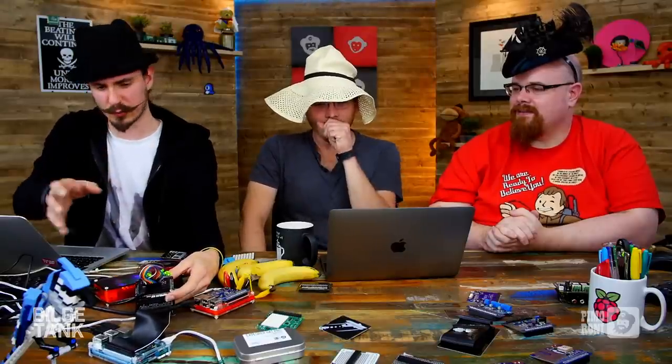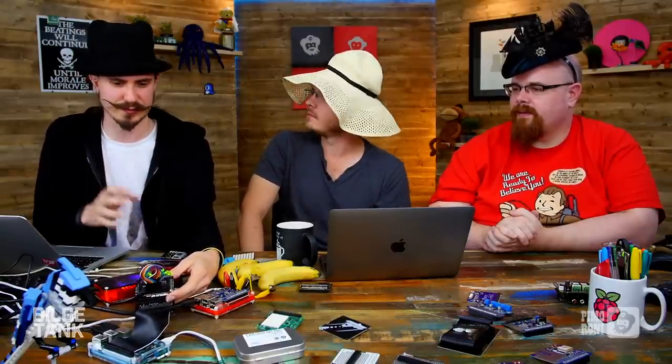Yeah, these are completely independent cores. And there's a kind of round robin system to negotiate between them. It's got a structure where there's a hub that dispatches code to each of the cores. So in theory, you can have the hub dynamically rewrite the code on any given core to give it a different task, but only crazy wizard geniuses actually bother doing that. For the most part, you'll set a core off to do a task, and it'll do that task, and that'll be all it ever does.